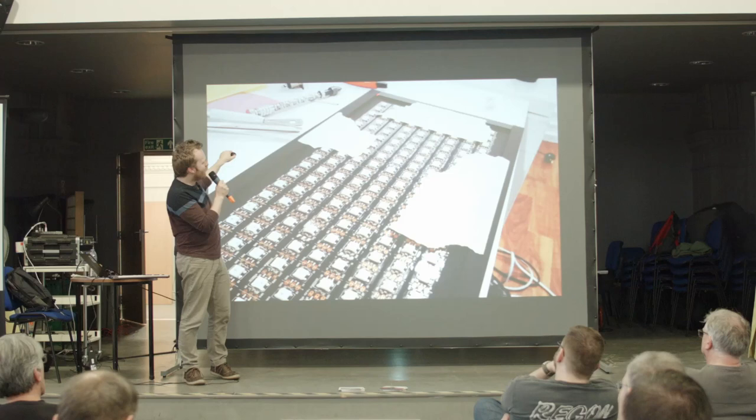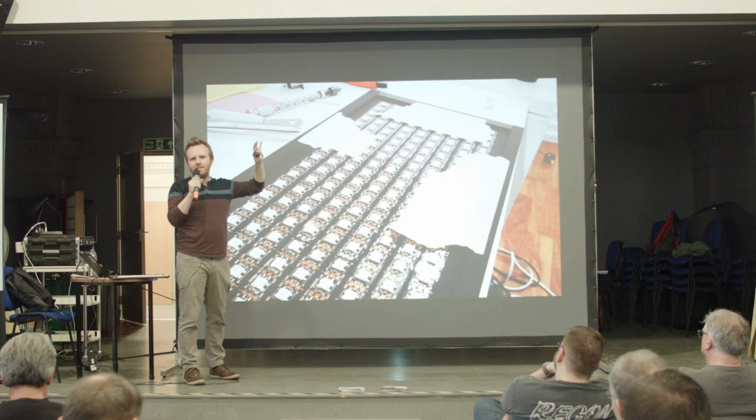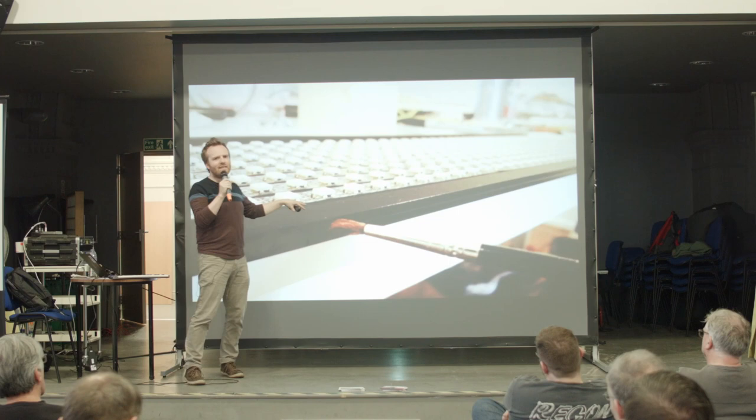I do have access to a laser cutter, but these were quite long. So I sent it to a plastic laser cutter in Portslade near Brighton, where I live. Those spacers were cut, again 3mm, and on top of that I glued them in with some acrylic cement, you know, the stuff that melts the acrylic slightly and bonds it really well.